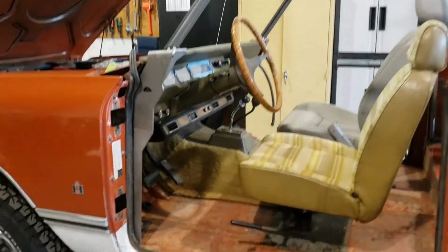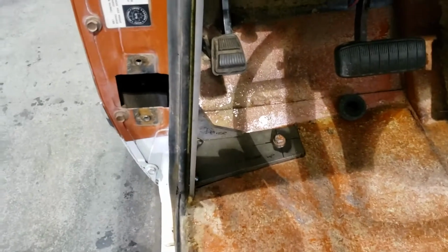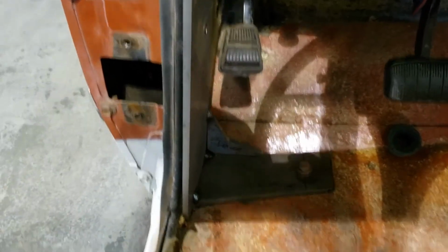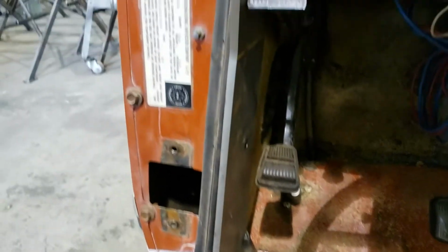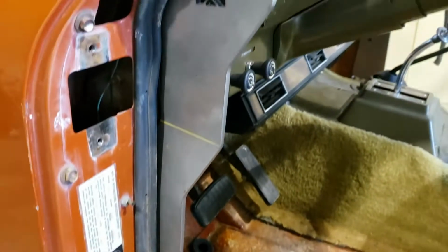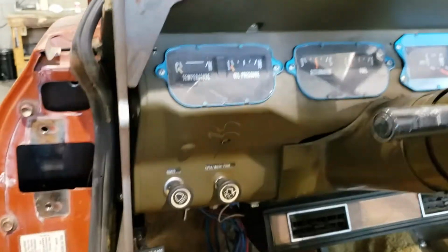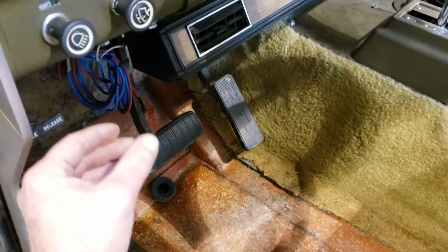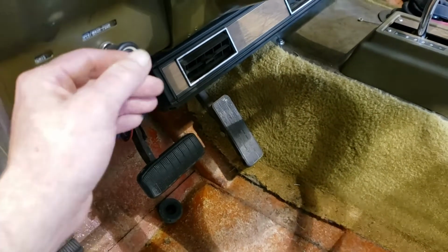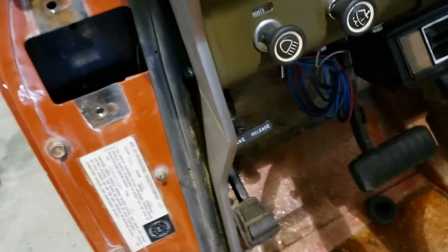Anyway, we can go over this cage quickly. Here you've got some really nice A-pillar mounts that are done by a company called Anything Scout. You can see I've gusseted them up the inside. This is 5/16 plate. That's all CNC plasma cut and CNC formed, to fit really nicely up around the dash, and it alleviates the issue of having a tube coming up in this area and obscuring your lights, some of your gauges, and also something to smash your leg on every time you get in and out of the vehicle. So this keeps everything clear.